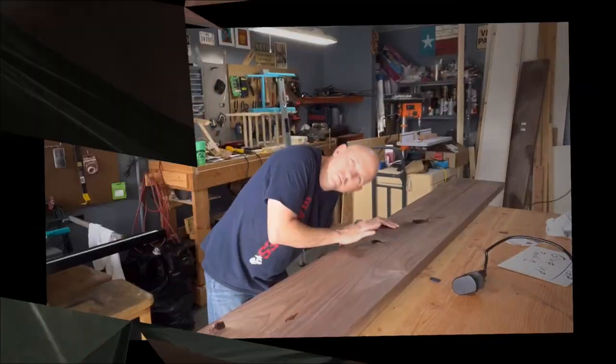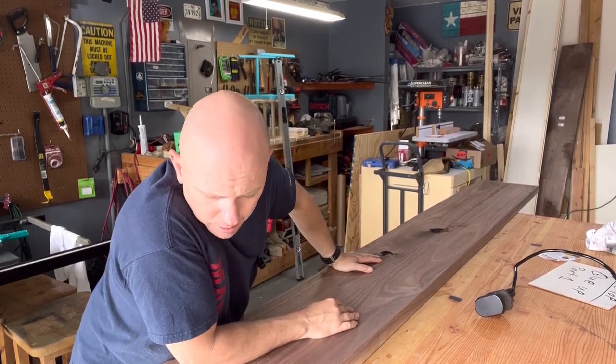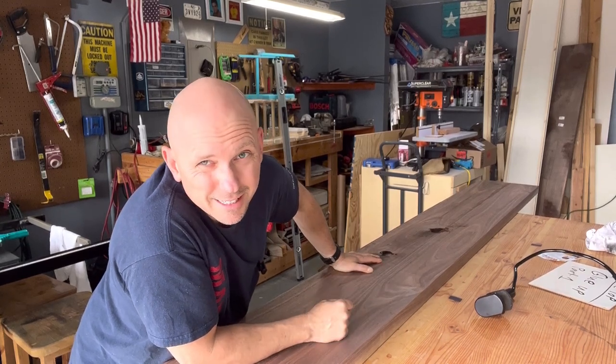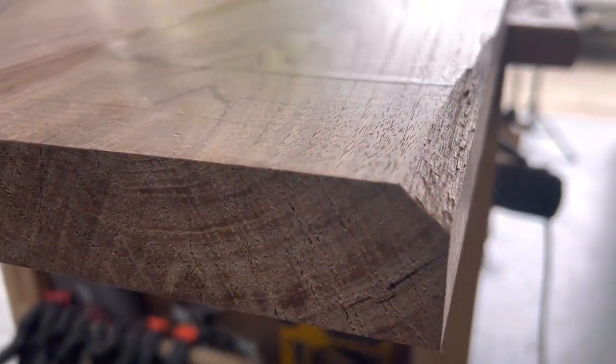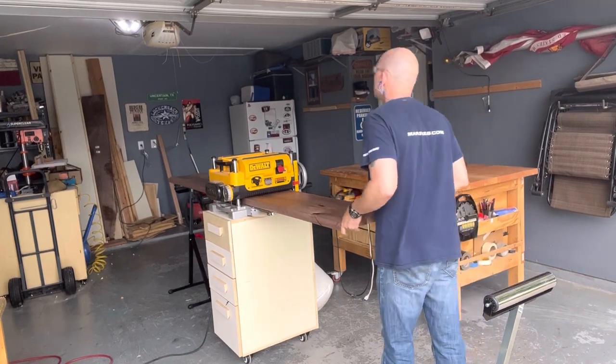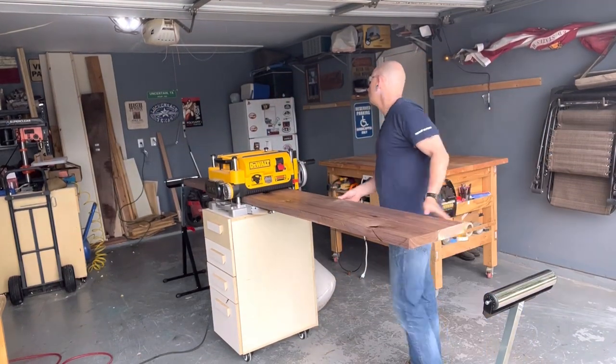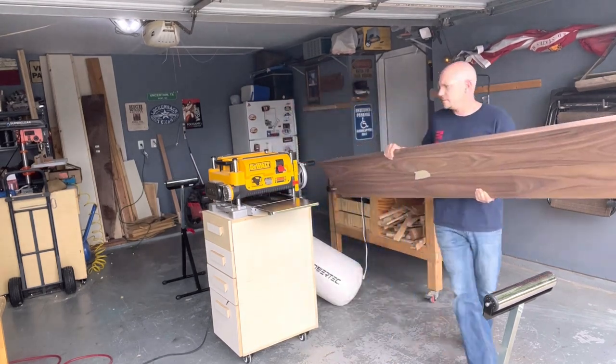The epoxy is hard — now I'll run it through the planer a few times. I'm going to put a quarter-inch chamfer on it because one edge popped out and kind of broke off — it had a crack. So the option was to try to glue it back on or go with a chamfer, and I think the chamfer will look very nice. I was really lucky this board did not end up being wider than my planer — it was about 12 and 5/8 inches and my planer is 13 inches. I ran each side through a couple times just to get the high spots down and take some of the epoxy down before sanding.